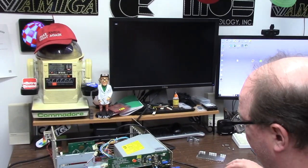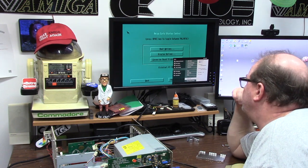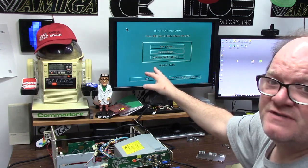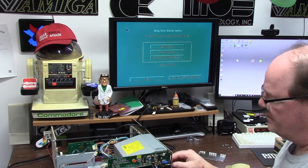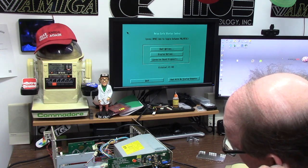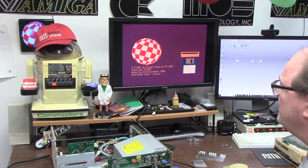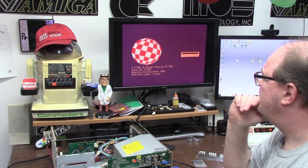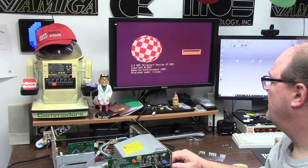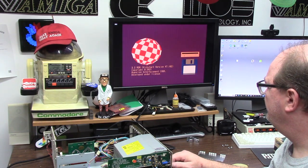It is blue — not white. This is in 640 by 480 at 60 hertz, 480i. So this is the 15 kilohertz side with the switch in the up position. Switch towards the Amiga is 31 kilohertz. However, it's blue — it's in phase, it looks correct, it's just blue. We can see the Kickstart ROM screen. That works. I don't know why it's extensively blue, but this actually looks okay. Flipping the switch back to RGB — looks fine.